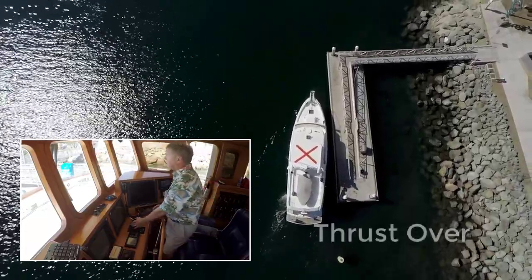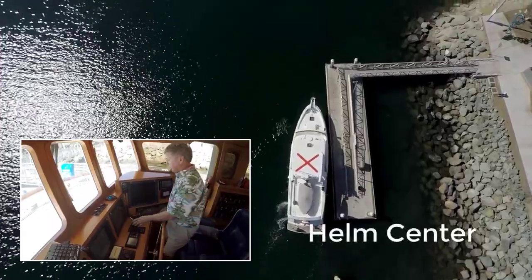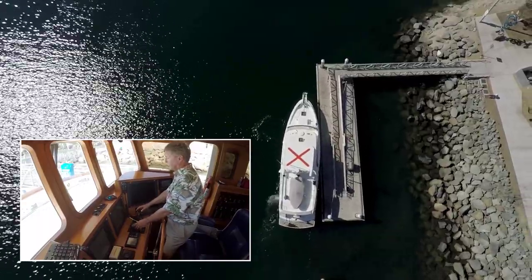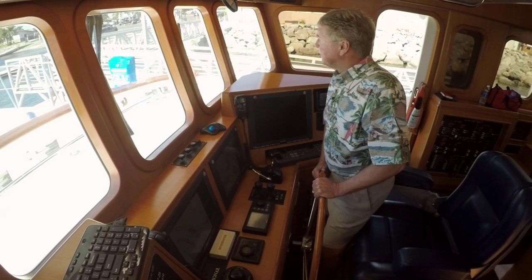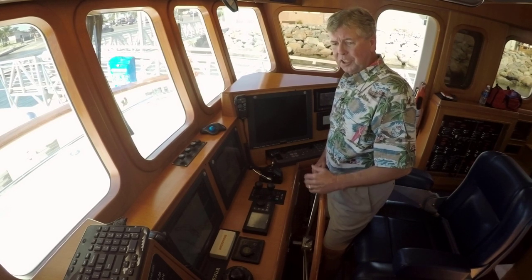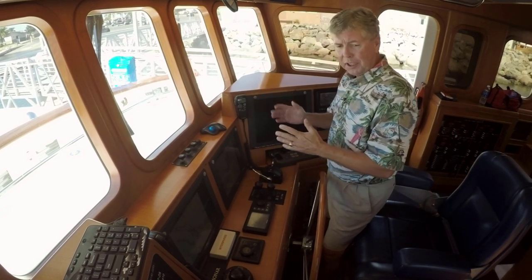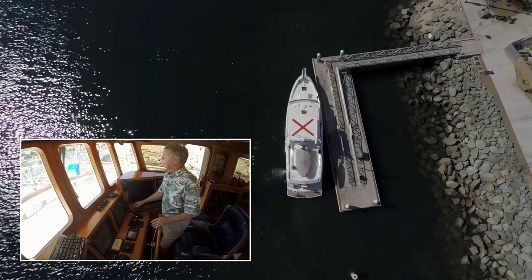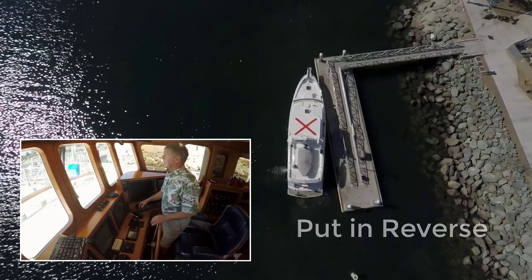From here I can thrust over. I want to make sure I put my wheel back at center. I'm in neutral, give it a little reverse and just glide in — the wind's going to help me here. When you're on a side tie you can leave the dock pretty easily. One thing you might not think about: you can go with the bow to starboard toward the dock to kick your stern out. I'm parallel with the dock right now; I'm going to put some helm in to bring my bow in, give it one little nudge, and then go into reverse. I have enough room up forward that my bow is not going to hit.